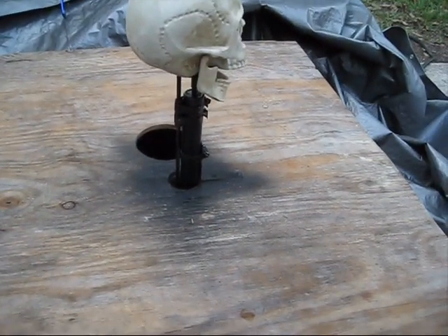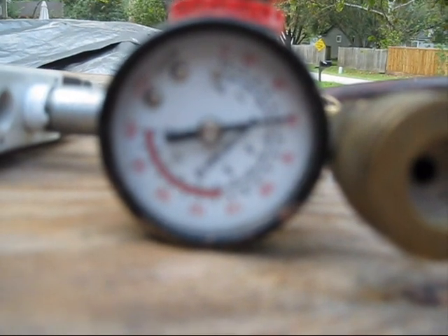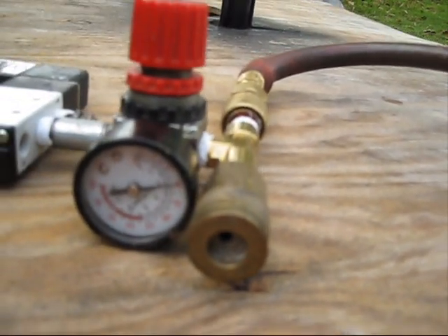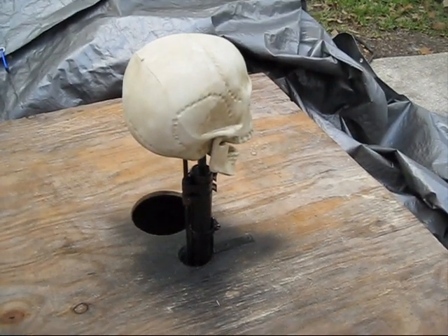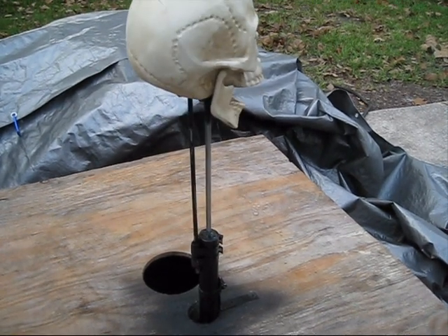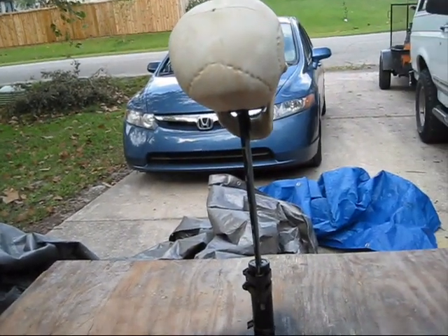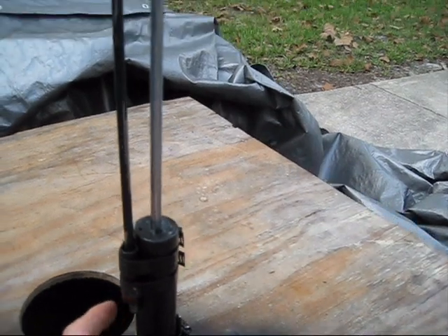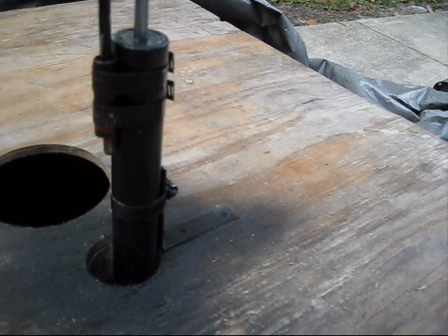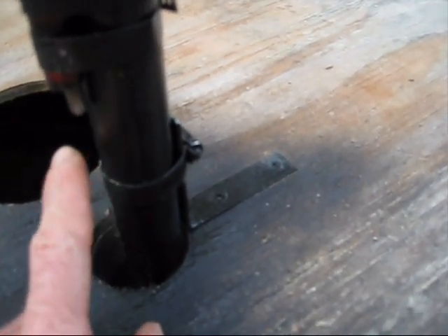We'll connect the air hose so you can see how it works. It's still leaking because we're using the same air fitting. Looking at the regulator, we're sitting just under 60 psi. You can see the skull is rotating a bit when it goes up — that's the spring inside the cylinder trying to make it rotate, but the rod prevents that. The rod travels the full length of the cylinder so it's still in the little tube when it gets to the top. The bottom of the rod is rounded off so that if it hits the hose clamps it doesn't get hung up on them.